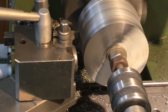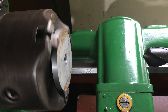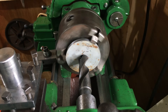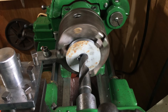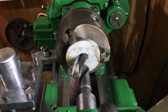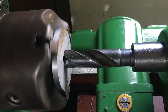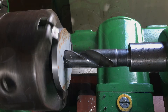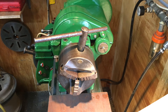After getting the washers unstuck from each other — because the remaining paint became glue when it got hot — I drilled each one as big as I dared in the bore, and I needed some material left in the bore to get any run-out removed before taking them to size. One of these threaded washers is for the 2 inch by 12 tpi arbor; the other four are for the one and a quarter inch by 12 tpi arbor.